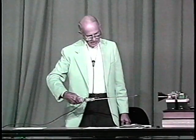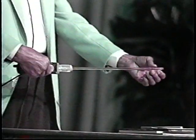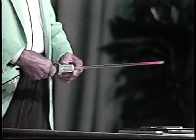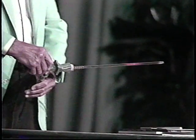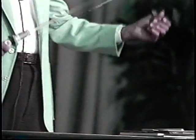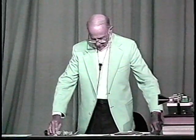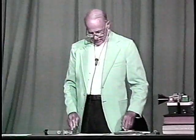Here's this polyrod antenna, and it's linearly polarized. But let me slip a little helix over this polyrod — look at what happens. It becomes circularly polarized. Just put a few turns of wire on there, and we've got a circularly polarized polyrod antenna.